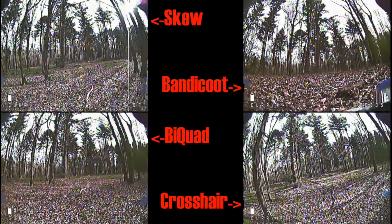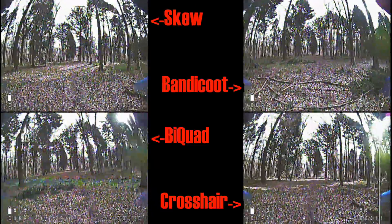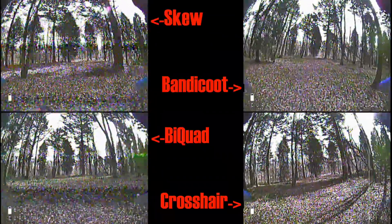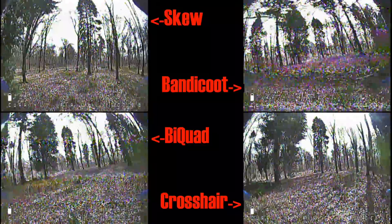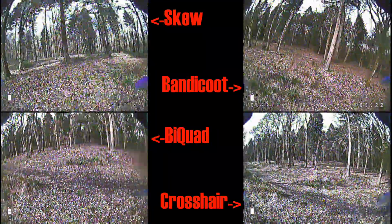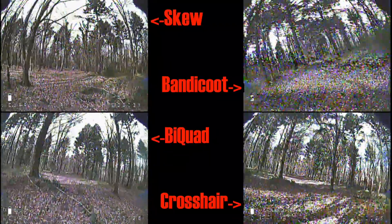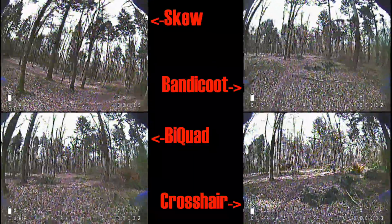During this time I had a few crashes — nothing too serious — but my intention was to take the dipole off and put the V antenna on. Unfortunately the little UFL connector actually ripped off. I managed to find that tiny little dipole to use on the QAV, went back, and flew it with the diversity setup. Here are the results — again, everything together. Hopefully you can see where the breakup is and where it isn't. Once again, for me, the crosshair was giving the best signal. With the diversity setup, the bi-quad came second, then possibly the Bandicoot, then the skew on its own.